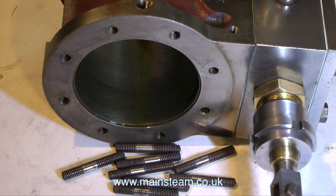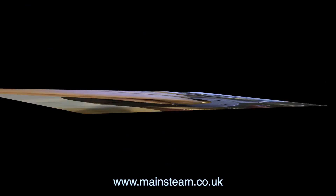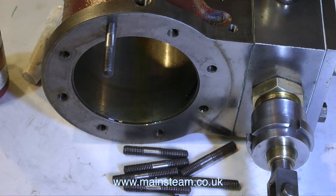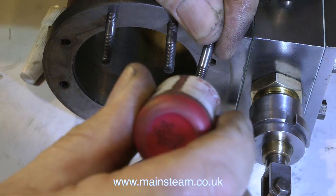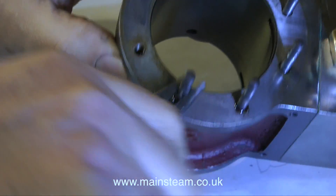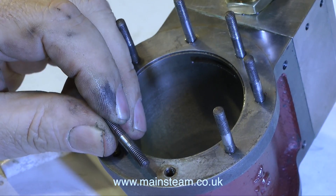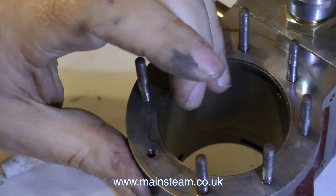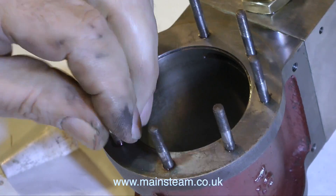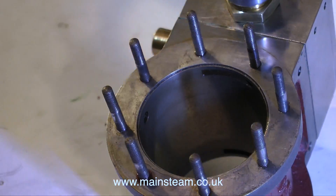Time now to fit the studs to the bottom of the cylinder. I already had these studs in a drawer in the workshop, and I'm going to put them in place with some Loctite 542. This is just to make sure that they stick in place and don't come out when I remove the nuts at the bottom. Please note, very important, this is not a bearing retainer — it is not Loctite 601, 638 or similar. This is just a thread sealant. I would not recommend using bearing retainer on steam engine studs; it's really not necessary. If you do use bearing retainer on model steam engines, it's not fair on anyone working on the engine at a future time — if they try and remove the studs, they'll probably shear off, because they will not be aware that they're held in place with such a strong bearing retainer.